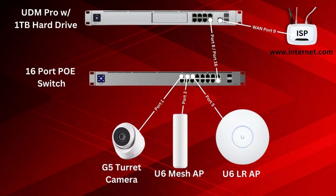The last thing we're going to talk about before we get into configuration is how this is physically connected and set up. If you take a look at the slide here, we have each of the three components I talked about earlier. We have our UDM Pro, which is our NVR slash router gateway — it's where we store our recordings and it runs the UniFi Protect software, but in this case it's also our router for the network. Then we have that directly connected to our PoE switch — that's part two of the scenario.